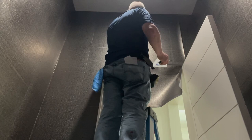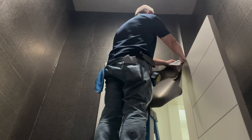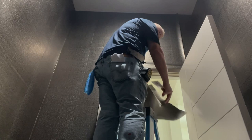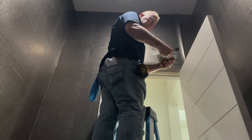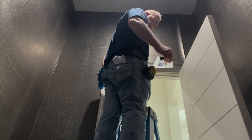One of the goals is to make the vertical parts of the pattern evenly spaced during this fake-out, to give the illusion of evenness or symmetry. As I show you the video in a few moments, you'll see what I mean by those vertical lines. If I just patched this and put it wherever, without consideration for the distance between the vertical lines — what is called the horizontal repeat — I would be doing the homeowner a disservice.